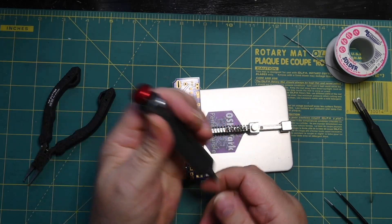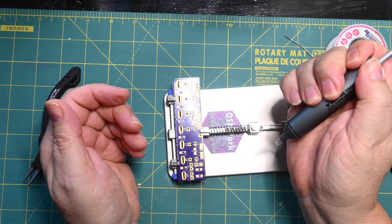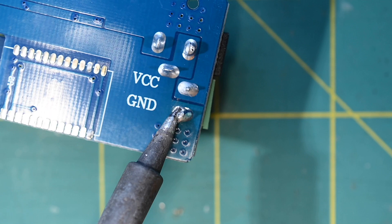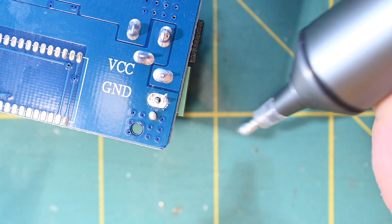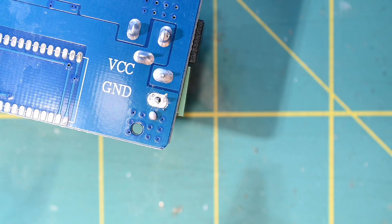You just charge it — I'm left-handed so I'll do it this way — and when you press it, it will suck solder off the board. It actually works better on through-hole components versus surface mount. I just heat the through-hole up, put the solder sucker on there, and you can see it took some solder out. When done correctly, there's no solder between the through-hole pin and the pad, and that's what you need to be able to pull the component out.